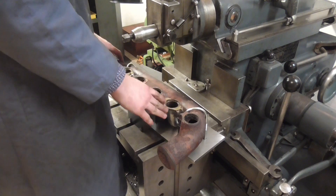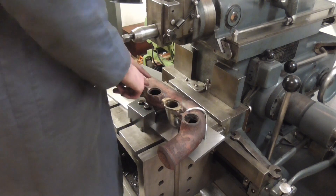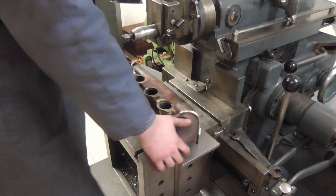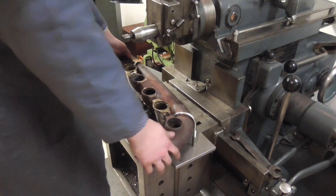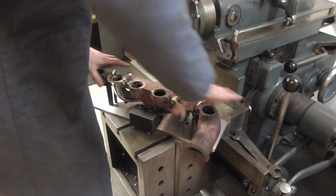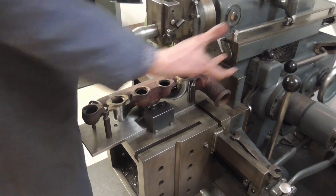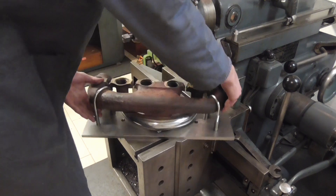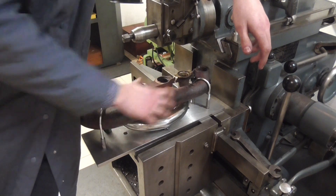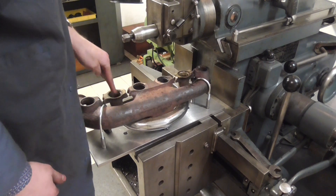Which I could never do with the vice because I would have to get it all nice and level once again and see that it's identical in surface between the two. So, long story short, I think this contraption now allows me to do that because no matter which way I slide it about, it is still going to be in the same clamping situation. So I can machine this part, then turn it around and machine this part — and in theory be done with it a lot quicker than by going across the whole thing a million times.